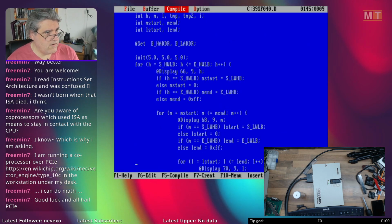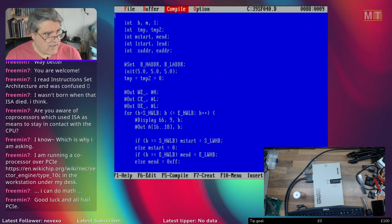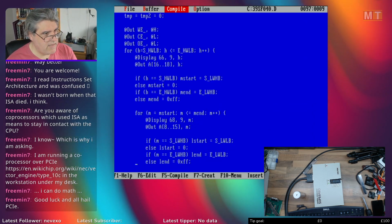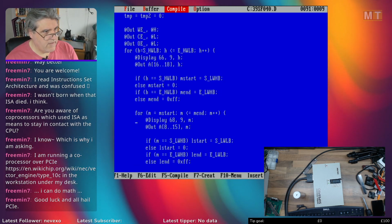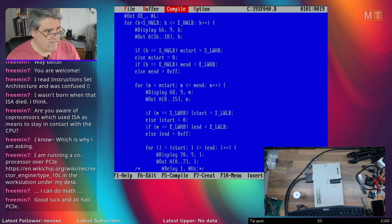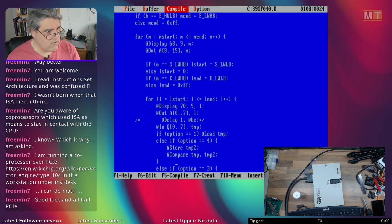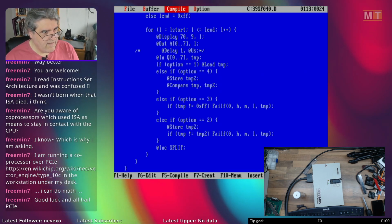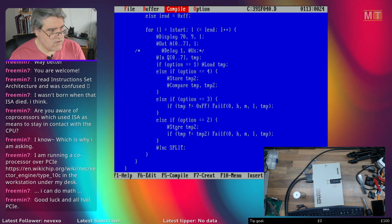To actually do operations, let's take a look at the read, for example. You have to have sort of nested loops based on bytes of the address. Bit awkward to do that, but perfectly doable. And twiddle the address bits and set pins high and low as you need and read them in. Store the data away or compare it with what's existing there. It's quite an easy programming language to get to grips with, so long as you know C.